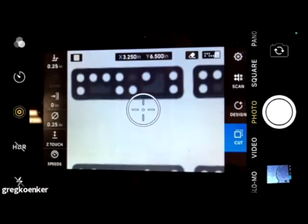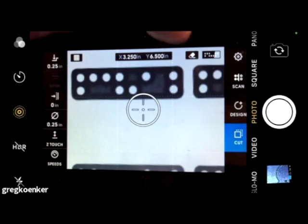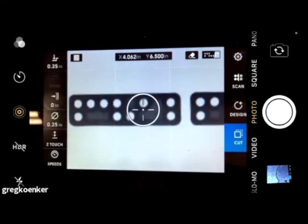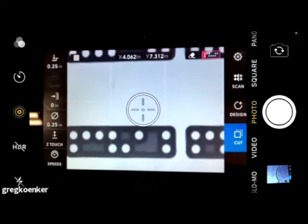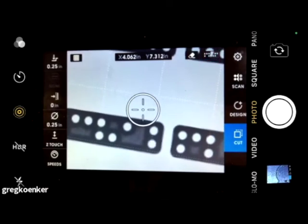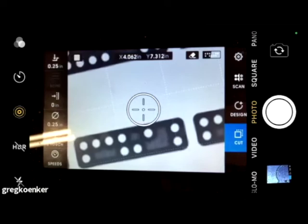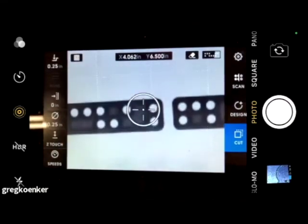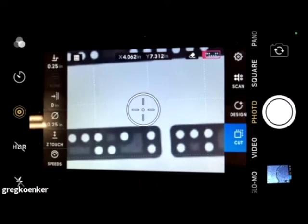And watch what happens. Now we've got a little void there at the end of the domino on the screen. And now we should drop another bit. Now we're down to the red. So I might be able to pick it up a little bit by picking up a few in the corner. But what that's telling you is, do you have enough dominoes to accurately cut? If you get to the red, you're in trouble. You know, even here, you're kind of in trouble.